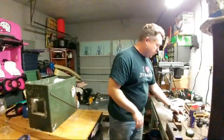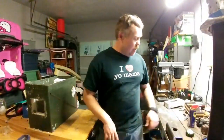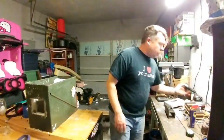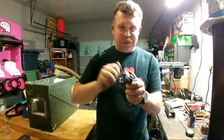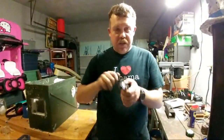That's awesome. Because this sea chest, it's a Viking style sea chest that I'm doing everything by hand, right? I'm making all the nails. I'm sitting right around 50 nails right now. I still got a lot more to make, but I'm getting there. I'm doing what I can. And then Chris Ames over at Green Bee Forge sent me a little hand cranked drill. Looks like a little gun. This thing's awesome. I'm definitely going to use this to pre-drill some of those holes, because you get those little square cut nails, and you don't want to just hammer that into the wood because it's going to split everything.